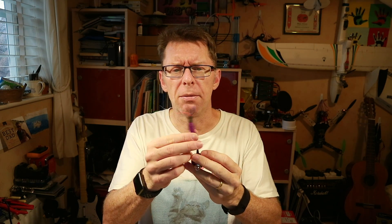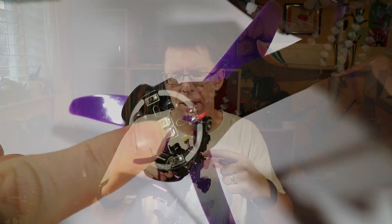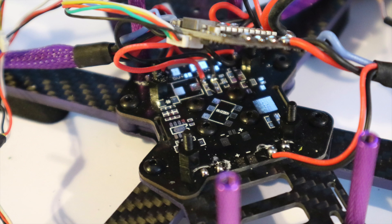The replacement motor is a little bit different in that we've got the normal three motor wires and then two extra wires. This is because of the LEDs on the bottom of each of the arms, so we need to desolder here and also on the PDB board underneath. Underneath the little LED light there's a plate and then a motor protector giving you access. There are three stack layers to get through, and on the bottom plate there's a sort of weird board that looks like a PDB but isn't really populated — it's used to distribute five volts to run the LEDs.